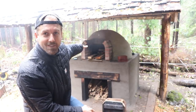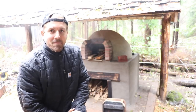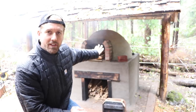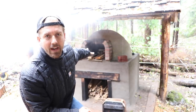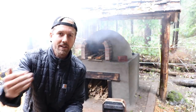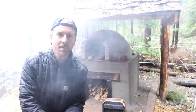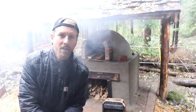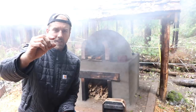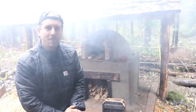Now, the brick oven, as you can see, is almost gone. You guys were the only ones to see it. Nicole and I and you guys. So you'll never see the bricks again unless you see it from the inside when we're cooking. So I've had a fire going for about 4 or 5 days straight, and I've been steadily increasing the size of the fire every day, curing my mortar, curing the brick, curing the cob. And I think we'll be ready tomorrow to put our perlite and cement mixture over this layer of cob, about 1.5 inches of this cement perlite mixture. And then when that dries, a finishing layer of cob, and then we're pretty much done.